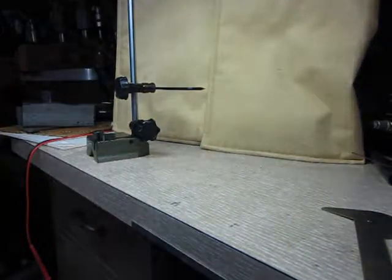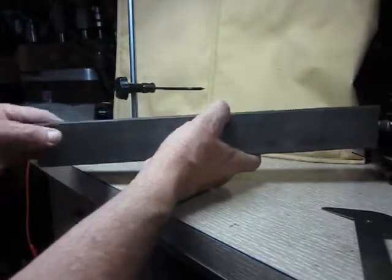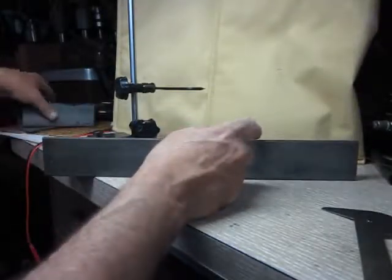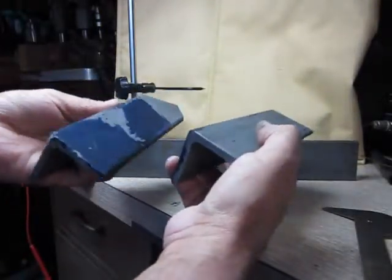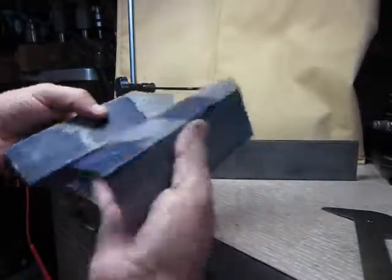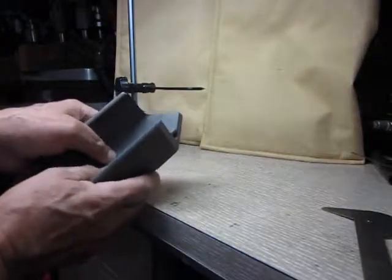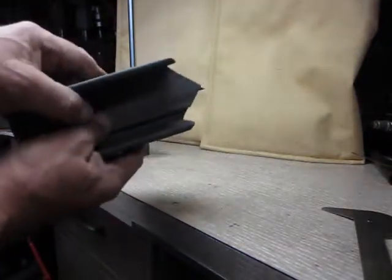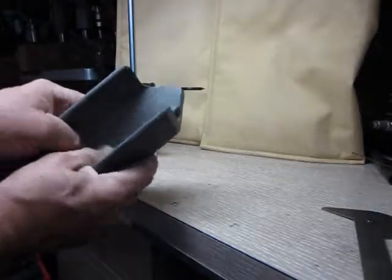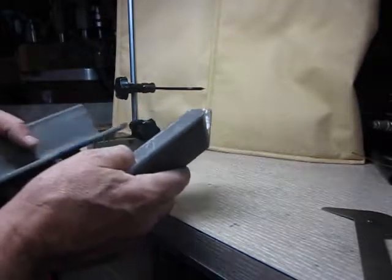We're talking about half of the total diameter. This is the cross member that I'm going to be welding the parts to, which there is a left and a right-hand part that will actually hold the axle in place. I cut these angles very accurately on a horizontal bandsaw. You can see how these parts actually manage to line up exactly — we have a 45-degree angle on both sides.